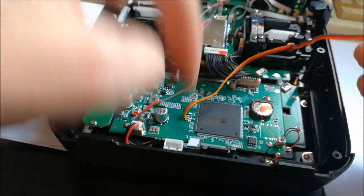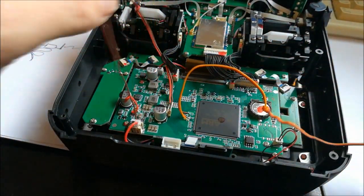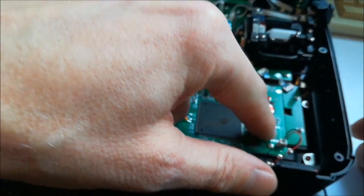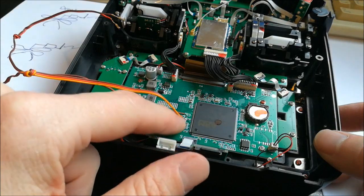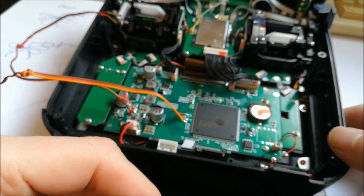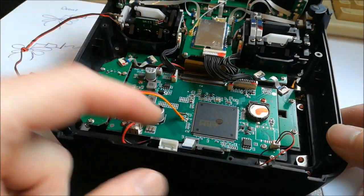I've opened the Jumper. I'm not going to de-solder things, so you'll understand the existing setup. Here we have the UART port wire and here the power wire. As for usable solder points — there are plenty. Here are the pins for the UART3 port. One could also use the pins from the Bluetooth section, and there are other available pins here and here. I've decided to use these pins here. If you find the Bluetooth area pins more convenient to solder to, let me know and I can modify the firmware accordingly.